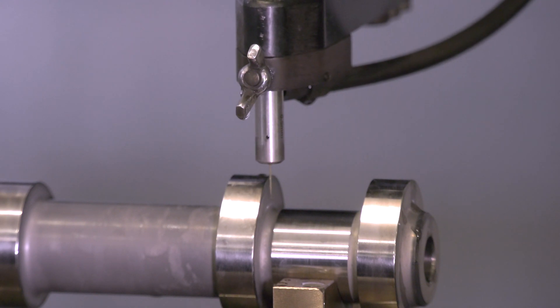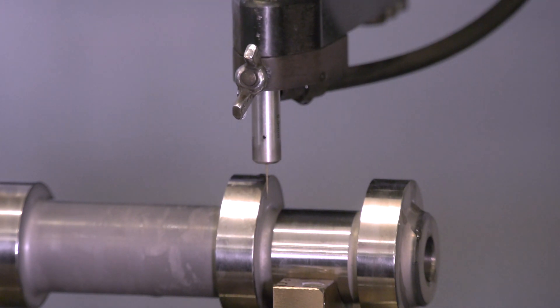Would you always need this process done after the part has been hardened? No, this is an unusual case that has happened a few times for us. With research and development, they decide they need more lubrication around the lobe area and ask if we can drill the cams — and they've already finished parts. Now we can.